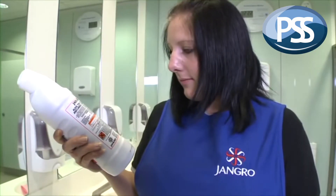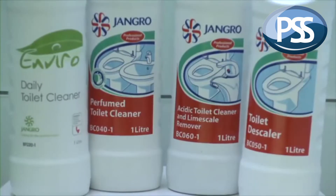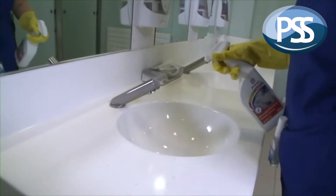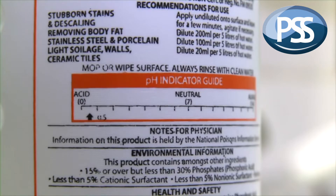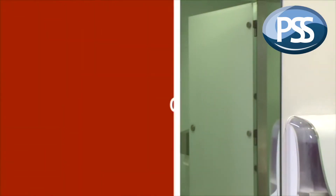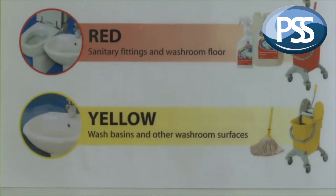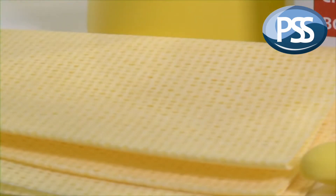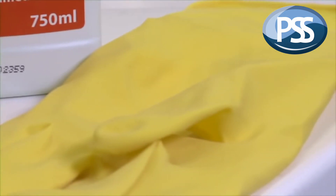Care must be taken when using washroom products — always read the instructions before use. The majority of washroom cleaning products are acidic and have a low pH number because they have to be effective against bacteria and limescale. The pH scale of 7 is neutral and the lower the number, the more acidic the product is. It's a legal requirement to have health and safety information on the label and you must obey the instructions. Most cleaning equipment and products used in this module are colour coded red and yellow, which means they are suitable for use in the washroom. The colour coding helps prevent harmful bacteria from being transmitted around a building, so it's important that we are all aware of colour coding and adhere to it.